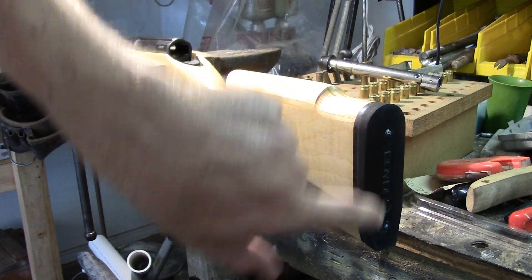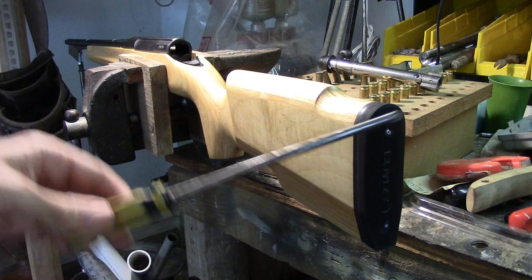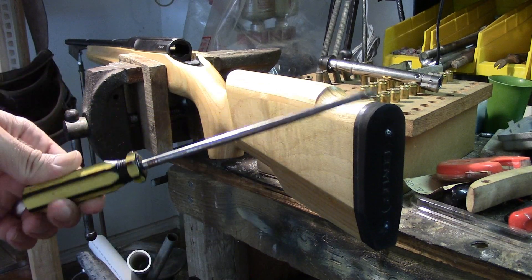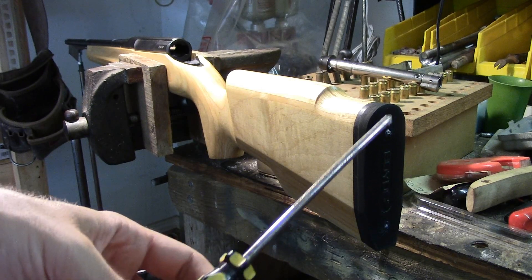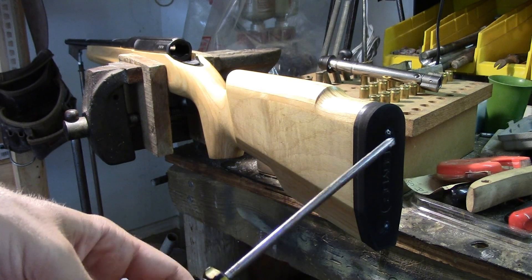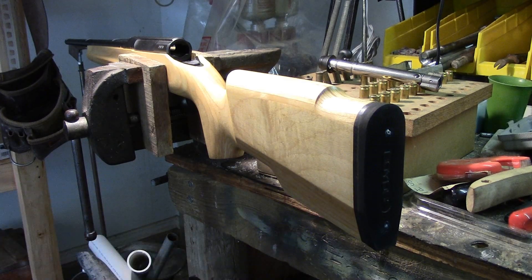What I've done is put just a little bit of grease on the two screw points right here, and I put a little bit of grease on the screwdriver as well. Because we don't want to tear this thing up — we want this to be as painless a removal as possible, just in case we do have to put this thing back on. Let's go ahead and unscrew this.